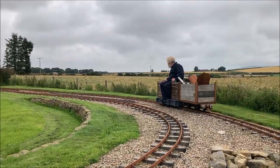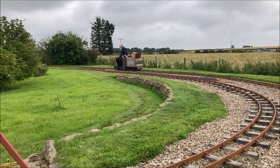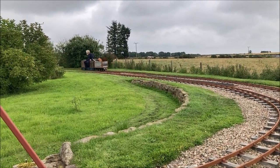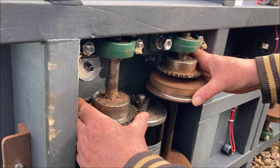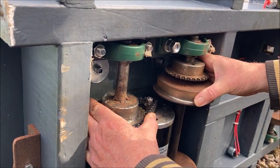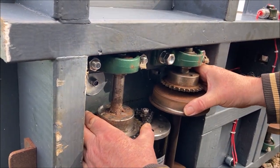None of these changes had made much difference. So because my locomotive is a variation on Colleen Edmondson's Scamp locomotive design, I checked the Scamp locomotive owner's Facebook group to see if anybody there had experienced similar symptoms. That's where I found the problem was axle spin, not wheel spin. The sprockets on the drive axle are held in place using taper lock bushes, so that the gearing can be easily changed.